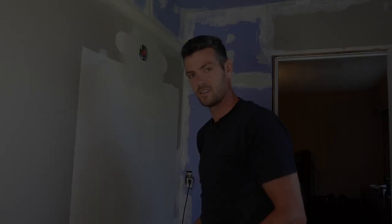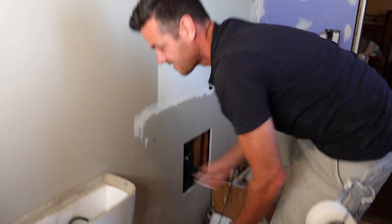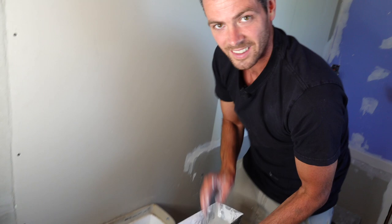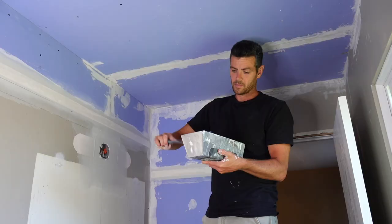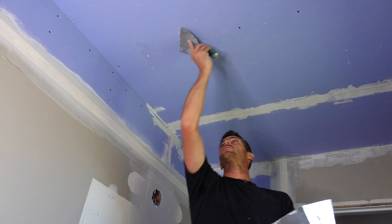What to do when you didn't put enough water in your mud? Just add a little water, but don't do this too long after mixing — it's known as re-tempering your mix, and that's not good. There are a couple other important times to add glue to your quick set: I find you don't always get good adhesion on screws, so screws is one place. And on steel corner beads — that's another situation where the extra adhesion of glue in your quick set can definitely help.